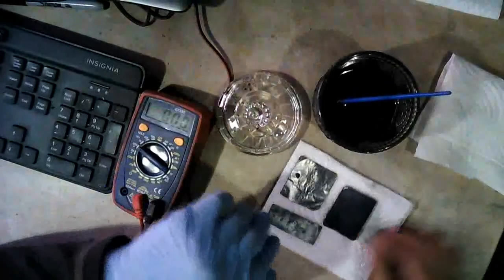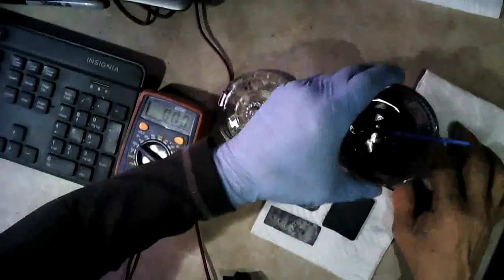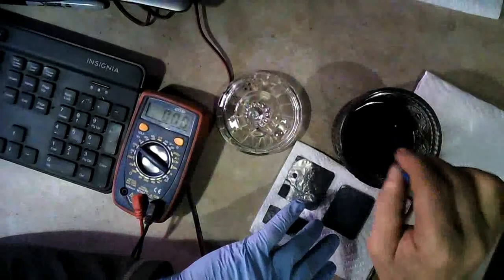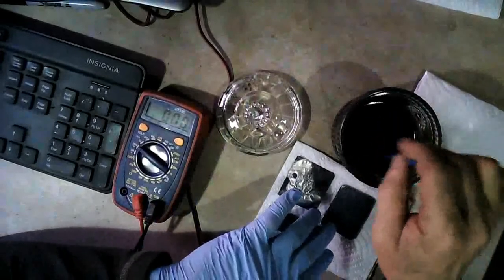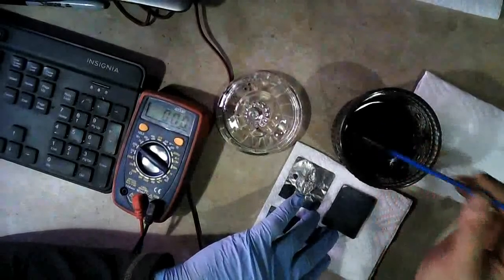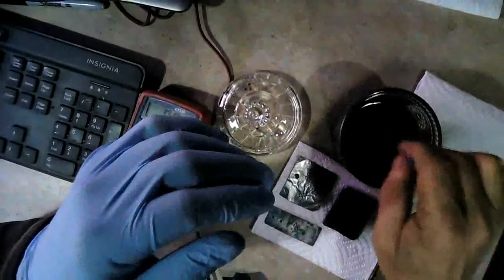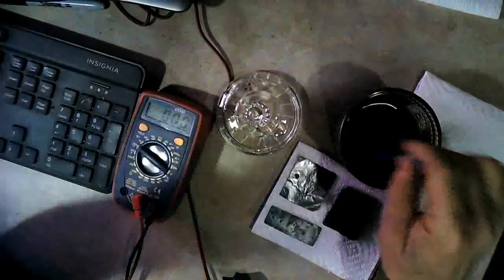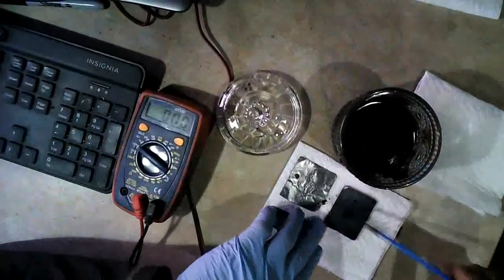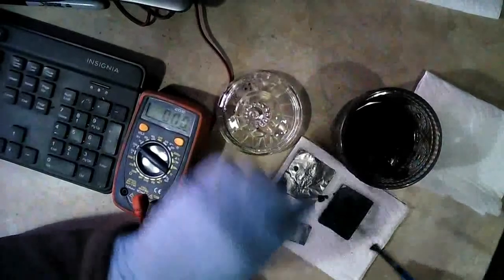It's acid, so I'm wearing a glove here, and we're just going to hope it absorbs right in there. I don't want to put water on it first because this is hydrophobic stuff — it's oily. I did add about five grams of graphite to it and put it back on the mixer to raise the conductivity. Let's see if it'll make a mess — it looks like it's going in, that's good.